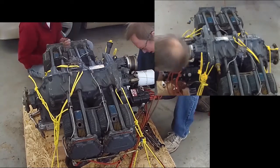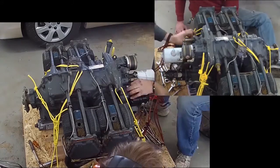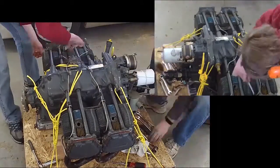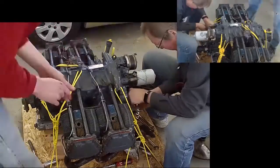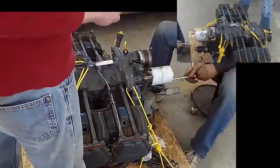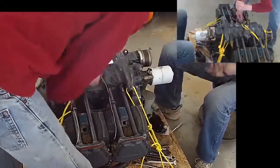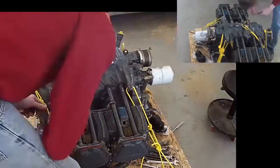Pulling things off — tops and bottoms. I've got the mags off, governor off. Mike starts working on the injector lines while I'm working on the vacuum pump. The vacuum pump is a lot easier to get off once you've got everything else off — in fact you'll see I get pretty far down before that vacuum pump finally comes off. Those were a pain. The injector lines are a little bit tight; one of them in particular was pretty well frozen. Mike did a good job on that.